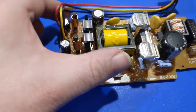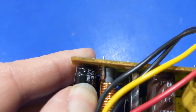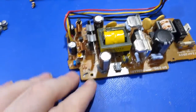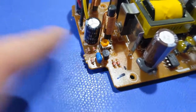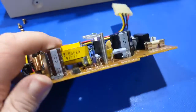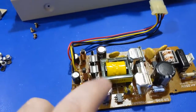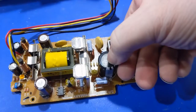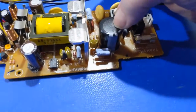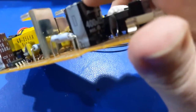I don't see any major signs of leakage anywhere. The only capacitor showing any signs is this one right here — on the positive side it's slightly discolored, and it may just be starting. So it's a good thing we got to this now. We've got a 1000µF at 10V, a 2200µF at 10V, and a 1500µF at 16V. What I like to do is take my fingernail and push to see — because these will look bubbled, but that doesn't mean anything. You push the plastic down and just feel whether they're flat. That one's probably fine and I don't see any signs of leaking from it either, but I will check it.